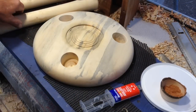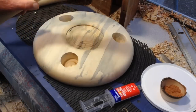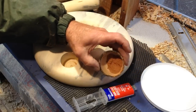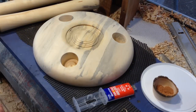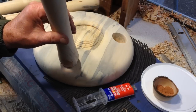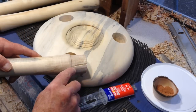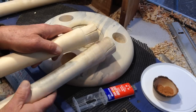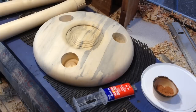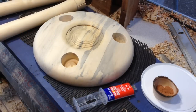So it's glue-up time, and the legs — two of them don't fit as well as they might. So I'm going to be using epoxy — five-minute epoxy — and I've got some wood flour to thicken the epoxy a bit. Two of my legs don't fit that well; this one does fit and will not require any wood flour. Now on these legs I've just made a little trench at one point to let the air out — it's quite important because I've found before that you can ram a leg in and then it'll pop out with air pressure. I don't have time to mess around with the camera, so you're not going to see me doing this.